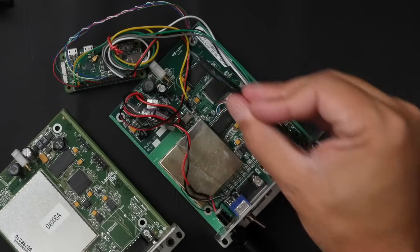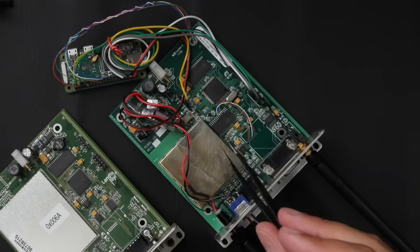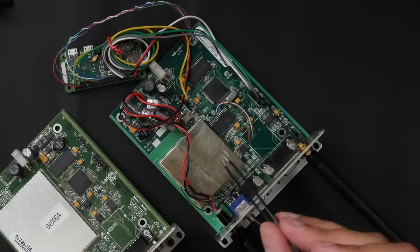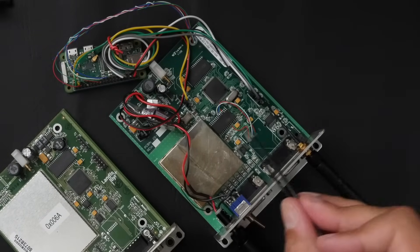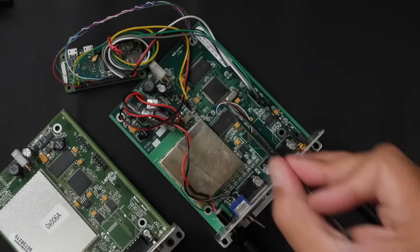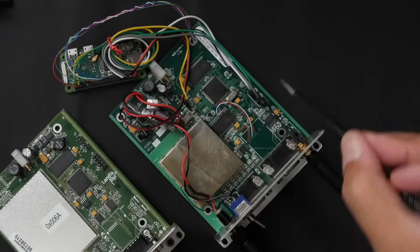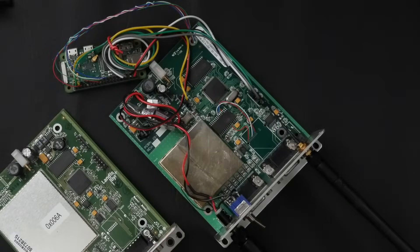There are some other things I have hooked up here. These are allowing me to control whether the board enters into a diagnostic mode, if the board is reset or not. And then a lot of little wires right here, which is what allows me to read out this memory chip and save its state — just like taking a virtual machine snapshot. I can take a snapshot of this at any time. I just hold the processor in reset, read out the memory chip, and release it from reset. The same thing you could do to write back to it at any time.